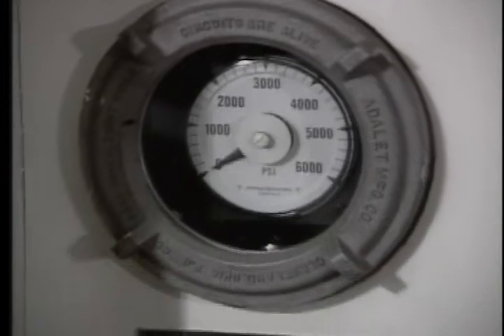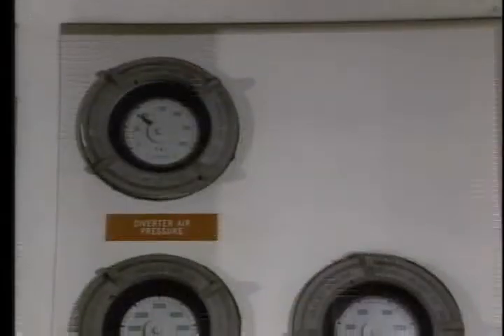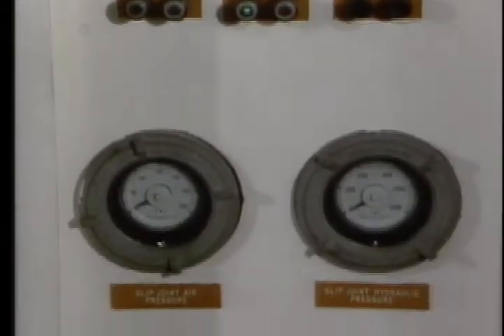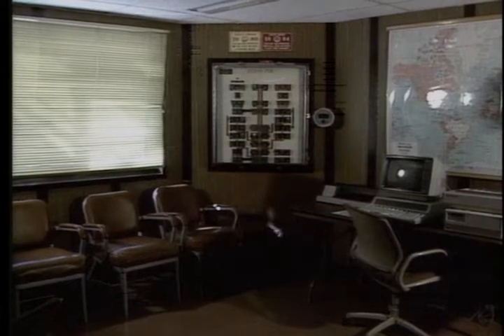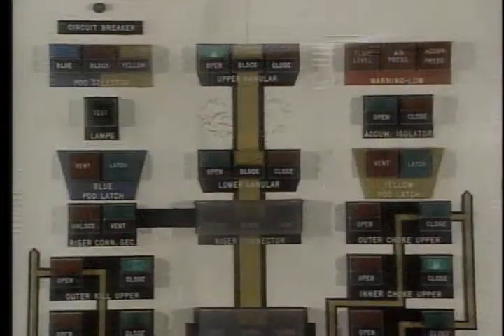Adjacent to each regulator station are the pressure meters associated with the regulators — one for pilot pressure and one for readback pressure. Three system pressure meters tell the driller the pilot, accumulator, and rig air pressure levels. The flow meter indicates the amount of fluid that's been used after operating a function. Then there's a diverter control section, which allows for remote operation of the diverter equipment; the functions and meters are self-explanatory. The mini remote panel is usually located in the tool pusher's office. Its primary purpose is to enable emergency operation of the BOP equipment if the driller's panel should ever become disabled. It contains the same type of functions as the driller's panel, without any meters or gauges.